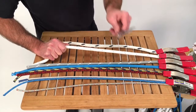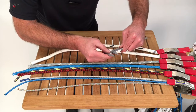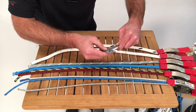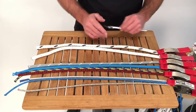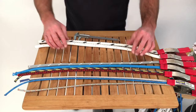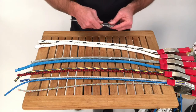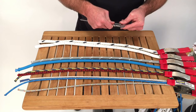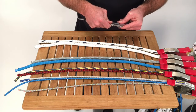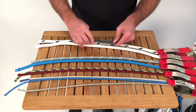Yeah. And I'm going to take a look at this. This just came in a hair under a half. So I'm very comfortable and confident I've got a 1/2 inch there. Okay, moving on. 7/16 line, some different constructions. I'm going to preset my calipers. Let's see, we've got 1/8, 1/4, 3/8, 7/16. Set the brake.